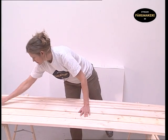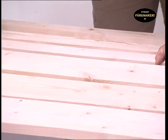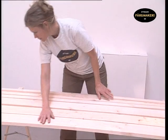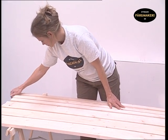One-coat paint for wood outdoors is used on untreated material that is absorbent, such as, for example, sawn timber. Note, however, that absorbent untreated surfaces require a lot of linseed oil. The end result is a lasting, beautiful matte finish.